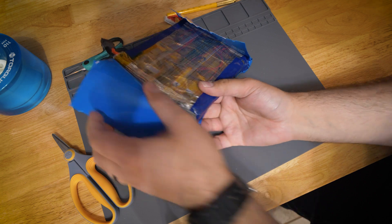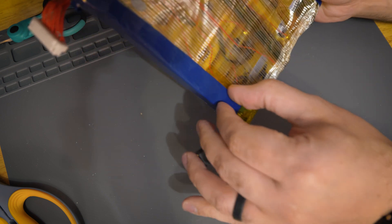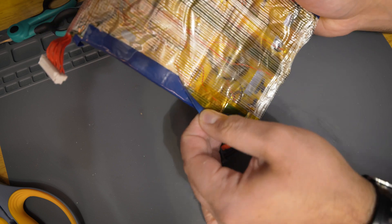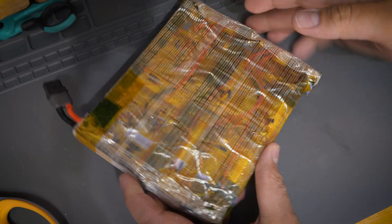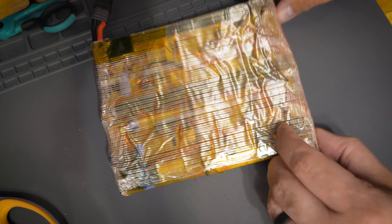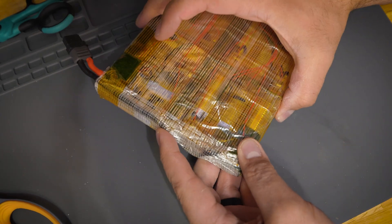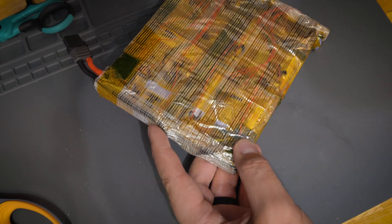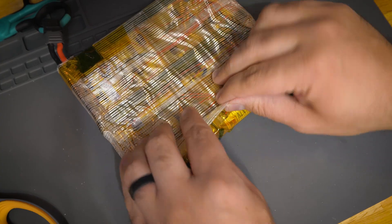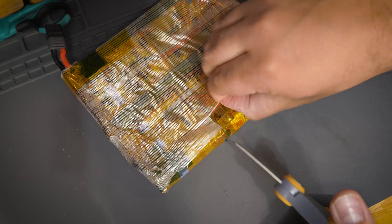There's a whole bunch of fiber tape wrapped around and what looks to be blue-ish electrical tape. Zooming in a little bit more, the balance wires are all throughout here and they all culminate on this edge and come out right there. Then you've got what looks to be the negative there and the positive somewhere down here. We see an entry point here at the bottom, so we're going to start peeling and cutting that and see where that gets us.